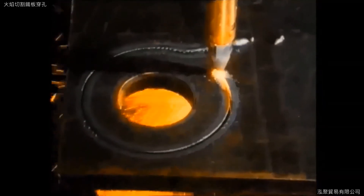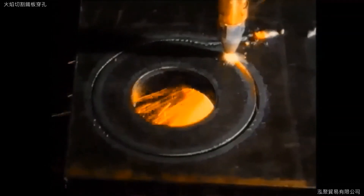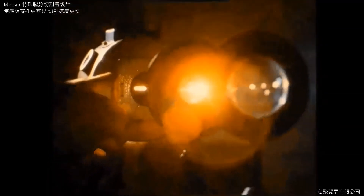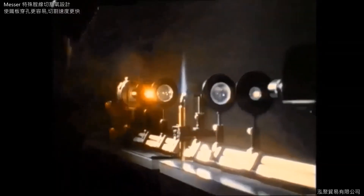Because perfect adjustment of the heating flame and the cutting oxygen stream is the vital basic requirement for good quality of the cut, we'll now examine these two factors. A conventional torch is integrated into an optical system that makes striae visible.